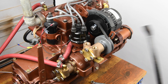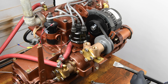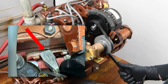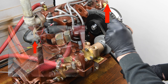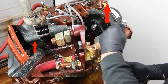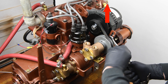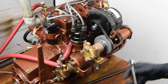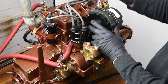It's time to tension our belt. I'm using a medium-sized crowbar, but you could also use a large screwdriver. Let the edge of the bar rest on the upper edge of the water jacket side plate, being careful not to pry on the side plate T-fitting. Pry up and lift the alternator — as you do so, the belt will tighten. We're looking for approximately half an inch of belt travel between the pulleys. Maintain tension on your bar and keep lifting the alternator as you tighten the alternator support arm bolt.